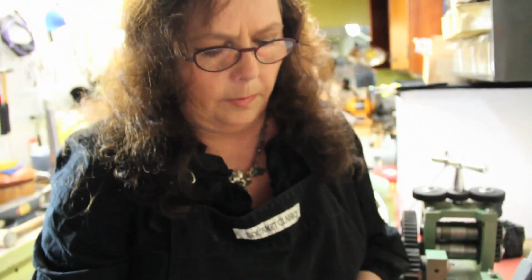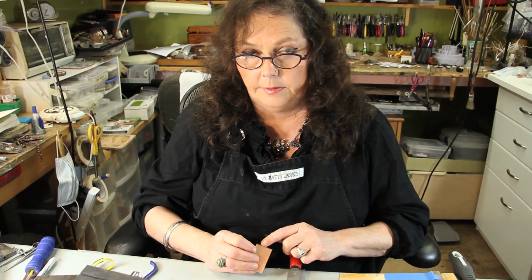We won't have to do anything special on it, but with the shears and a sawn edge, we need to do a couple different techniques, so we'll go do that now. This one that I cut with the French shop shear, I obviously flunked scissors in kindergarten, but I did it on purpose, so that I can show you how to true up the edge on this. Having a file this size is very helpful. Using the little tiny ones just makes this mind-boggling insane.